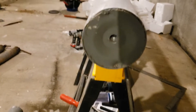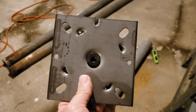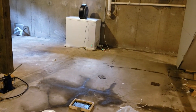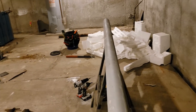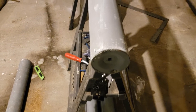These columns are a system, so I wanted to show how these top plates go on. The column is built with a steel cap on the top with a threaded insert, and then this plate has a recessed socket for this big bolt and has tabs that go around this end. I measure the gap from there to there, cut this column roughly an inch and a half shorter than the distance between the floor and the carrying post. I'll come back and show you how it all goes together.